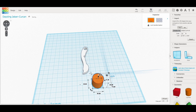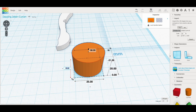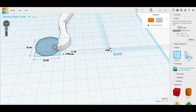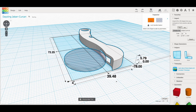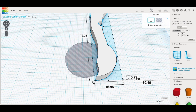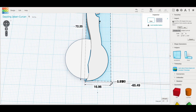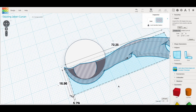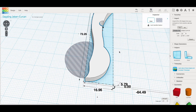I brought in a cylinder because I want to make the shape of a quarter — well, slightly bigger. So I made it 25 millimeters in diameter and 2 millimeters tall. Then I made this into a hole so I could take away space on the arm. But first I had to line them up using the align tool so they're in a level position. I moved the arm into the coin to take away material, but I couldn't tell how deep I was going, so I reversed them — made the coin solid and the arm hollow. There was a little corner too close, so I moved the arm slightly, then reversed it again, making the coin hollow and the arm solid, and grouped them together.